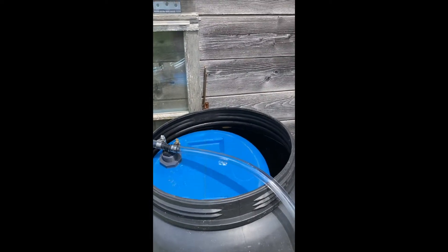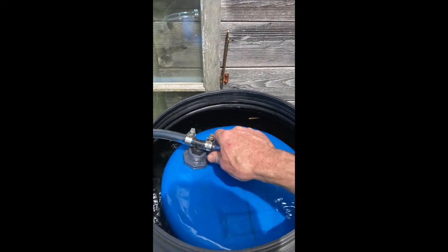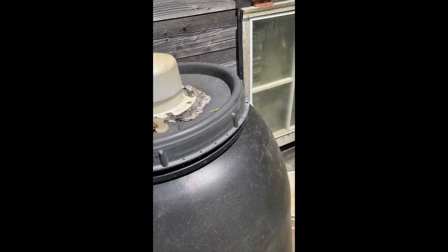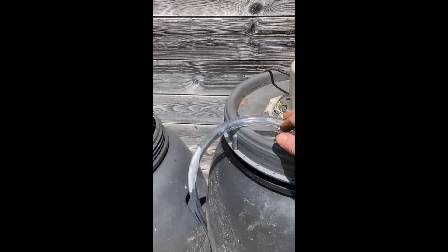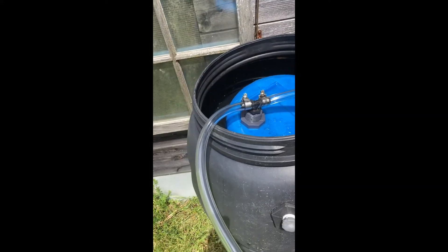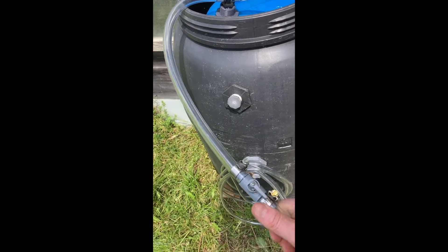This is the gas storage unit. One barrel is filled with water. As this barrel fills with gas it will rise up. So: feedstock in, effluent out, gas out through the safety water trap, bubbling into this barrel, filling it up, then gas comes out through the gas valve. On and off. Pretty simple.